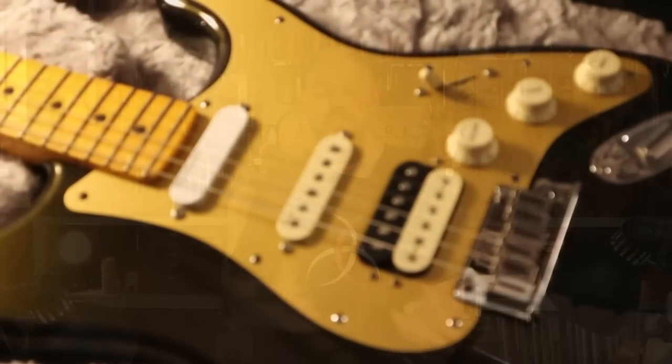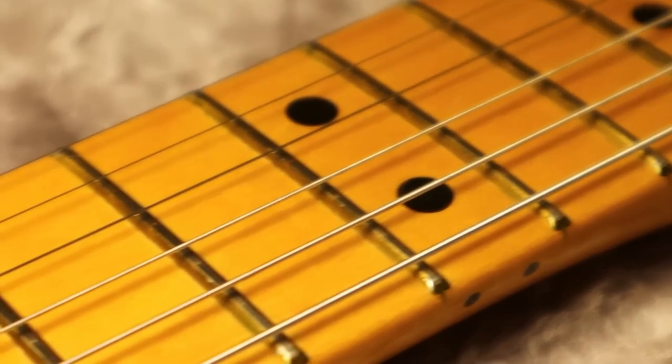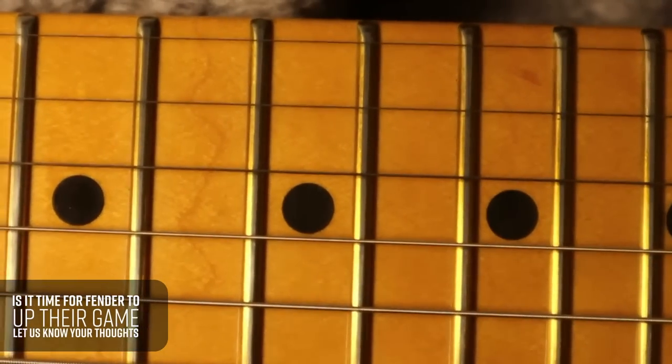As evidenced by the fact that we recently had a really expensive top-end Fender Strat Ultra — something, something — it's a two-grand guitar, and they just don't even bother doing it. Fender, even at that price point, will just run a leveling beam or file over the top of the frets, and then just leave the lacquer on the side of the frets looking all yellowy and nasty. At that price point, I just don't believe that is good enough — I do, however, understand why.